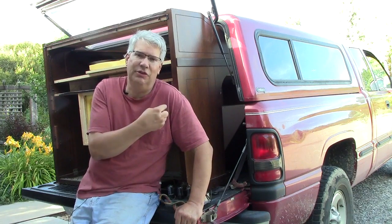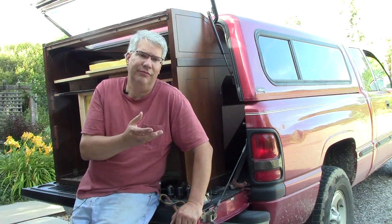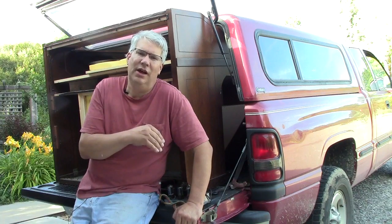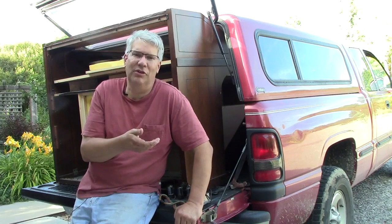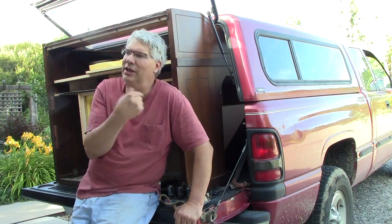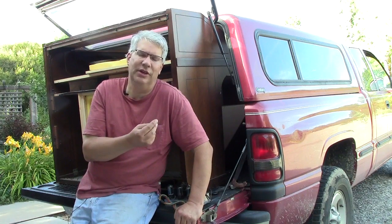And then behind here, what you can't see is a Wurlitzer, like a 1961 model 4100B, and I don't know what the condition of that is. I do believe it has roughly 30 tubes in it to get out the voices. It has a 6L6 output stage, so that one's going to put out about 35 watts. So between the Bendix radios that I got from Jerry and this Wurlitzer and the speakers, also that Wurlitzer has 2 vintage Jensen C12R speakers in it.